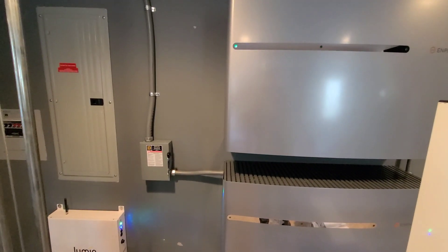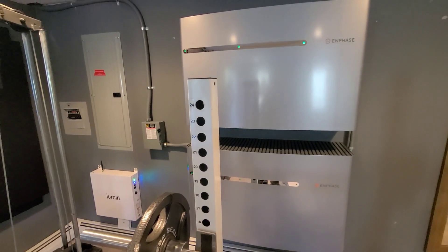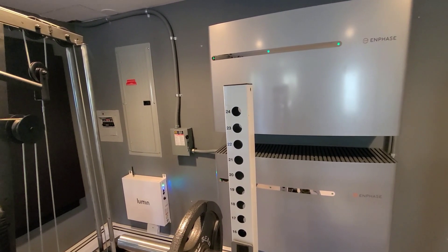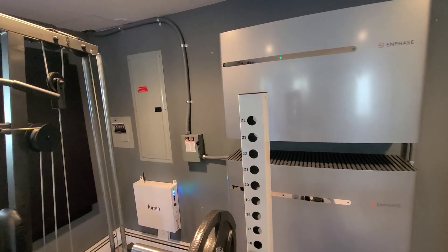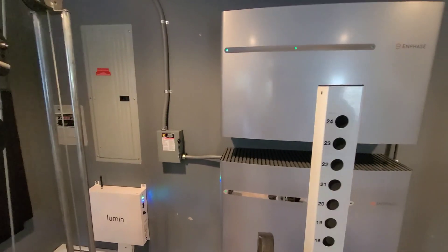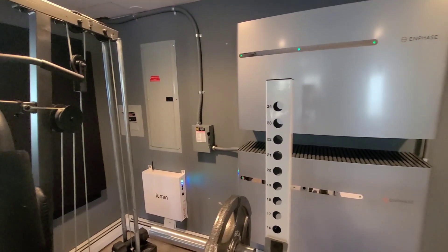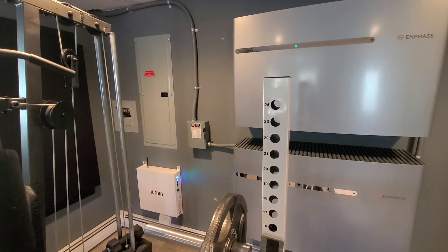We are going to be doing a bunch more systems like this. We've kind of switched over — well, we're still doing a lot of Tesla Powerwalls — but we've switched over to these. It's a higher-end battery, a little bit more expensive, but the difference is we can get them. For one, it's got a lithium iron phosphate battery instead of NMC like the Powerwalls. We also only install microinverters on our roof and ground mount systems, so this integrates seamlessly with those. Thanks for watching guys, and I'll try to do a full video on an installation of one of these coming up.